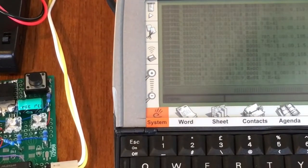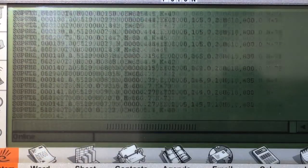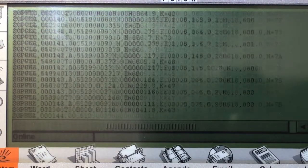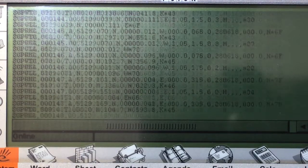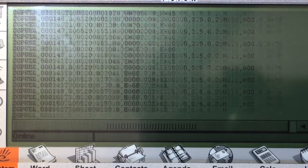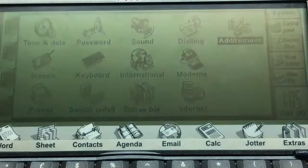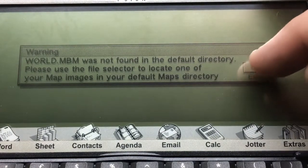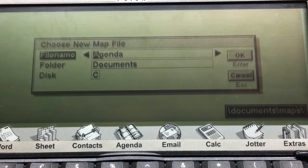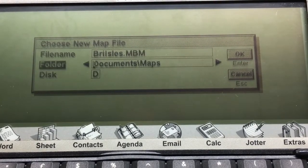So given the location, looking at the previous location, you can calculate the forward bearing, the distance between the current and the previous location as the track log is scrolling. And assuming that the points are 1 second apart, which is a big assumption, you can also calculate speed. So that's a bunch more data that you can calculate for insertion into your NMEA sentences that wasn't originally available in the GPX track log file.